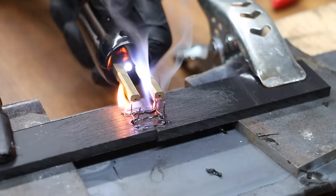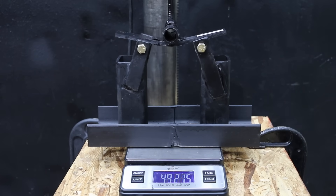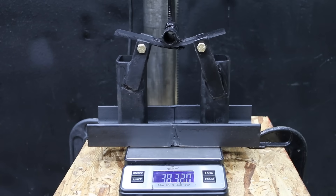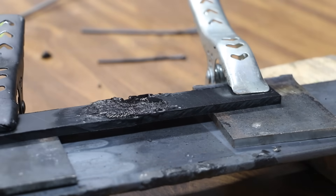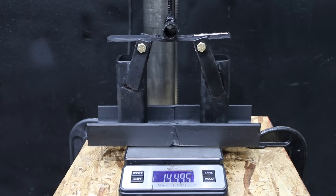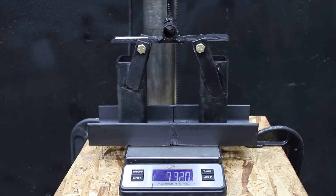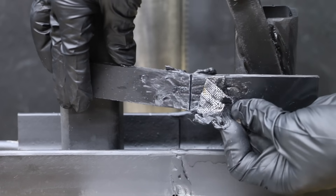The O'Mary plastic welder makes plenty of heat to embed the wire mesh, and the wire mesh really added a lot of strength — 61.8 pounds is the strongest of the wire mesh repairs. Testing the opposite side still showed pretty strong results at just over 38 pounds. The Beyond Life did not come with clear instructions, and the weld didn't do a good job sticking to the HDPE — the test piece without wire mesh gave up at just over 24 pounds. The wire mesh helped significantly, bringing the Beyond Life repair to 48.1 pounds — twice as much as the plastic-only repair.